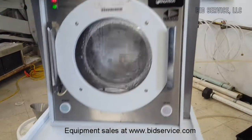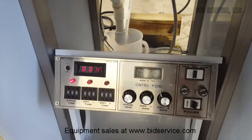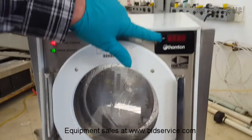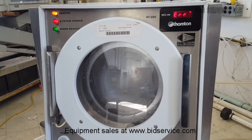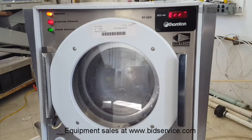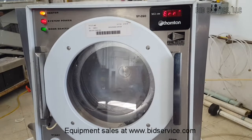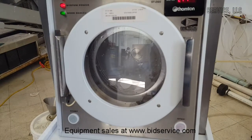You can see our door has locked and we have water coming through here. Down here you can see we're counting down and we're in the first cycle. You can see our resistivity reading here. It has a much higher RPM for the dry cycle — the first dry cycle is very high, the second dry cycle is low. And you can see our heaters have just come on. And we're in the second stage. The second phase is low, and now we've gone to the third stage.